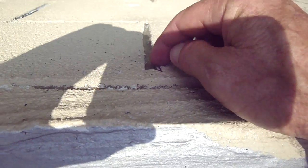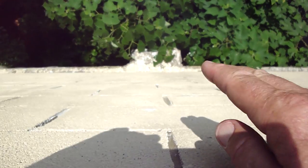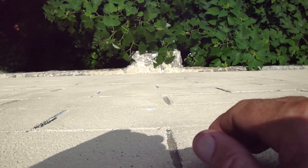So the problem here is this block wall needs to be waterproofed better, and that little ledge down there — that little lip — needs to have a cant put on it so that if water does come down this wall, it's channeled right over the top of it and doesn't dam up and push back in. That's the way we see it.